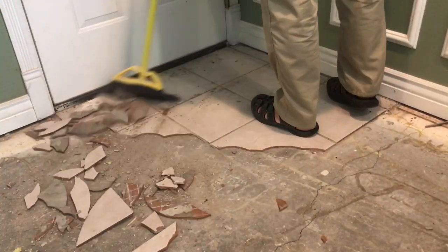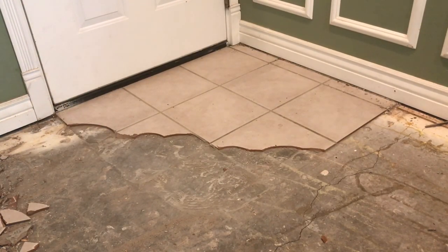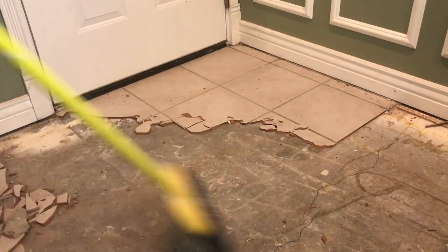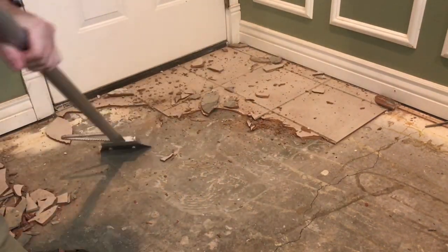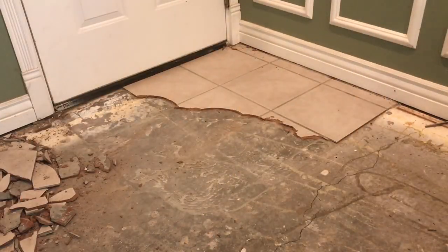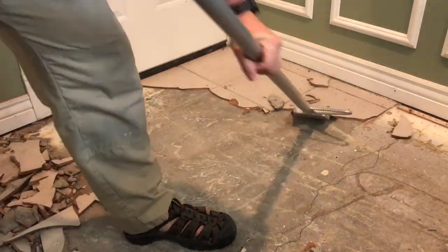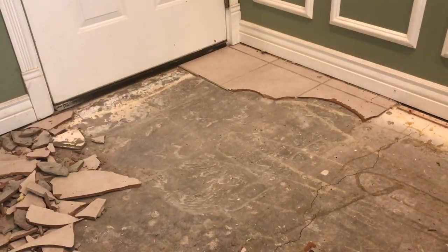The rental of the heavy-duty scraper was going to be $100 a day, plus I had to pick it up and drop it off and leave another $100 for a deposit. So I went with this handheld scraper, which overall worked pretty good. Use of it is fairly straightforward — simply lay the blade flat on the floor and push hard and fast against the edge of the tile. You may want to play around with the angle of the scraper, as you may experience the tile breaking on a tapered edge where the scraper rides up and over the tile instead of going underneath it. When that happens, I just used a hammer to break up the tile a little more and then went back to the scraper.